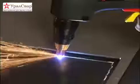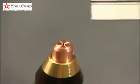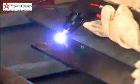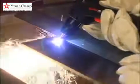You may use a circle cutting guide, a straight edge, or a template to guide the torch. However, the distance from the shield center to the edge must be factored in when creating a template or deciding on the placement of the straight edge. If using an angle iron for beveling, remember that the material thickness increases proportionally with the bevel angle.